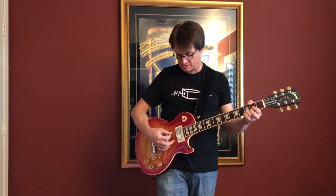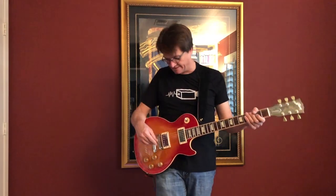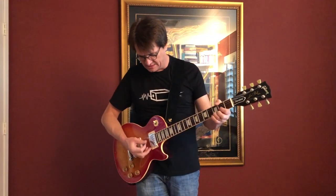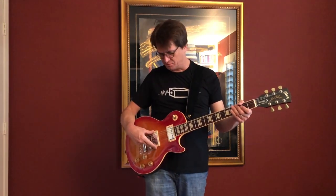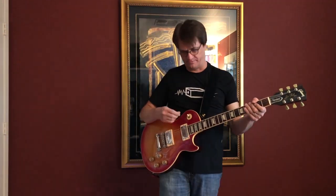We did the neck at 500K. I like it — it's got a little chime to it. Now, if you really want to make this kind of like a woman-tone type sound, as Eric Clapton used to say on his guitars, then maybe wire this at 250K — it'll get that real nice, warm sound. Definitely hear the difference. In a way, we kind of took this pickup and moved it up a little bit by taking it to 250K. But you still hear the difference going from the bridge to the neck.